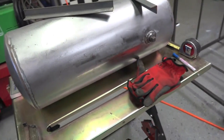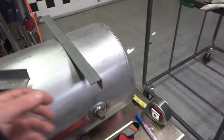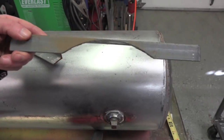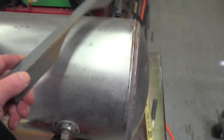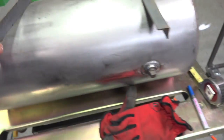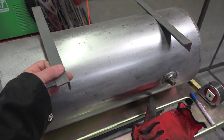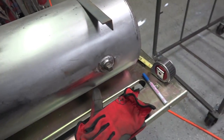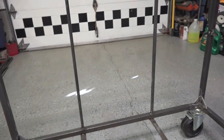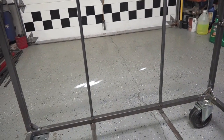What I'm doing right now is taking a piece of angle iron and cutting a half-moon notch to the same radius as the tank, so we weld in what we notched out and get it welded on there. That's going to allow me to mount the tank on those two braces right there, which allows me room for the pump.